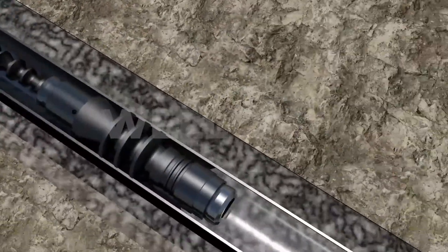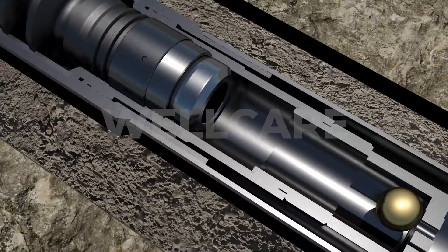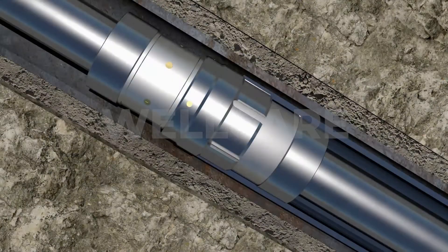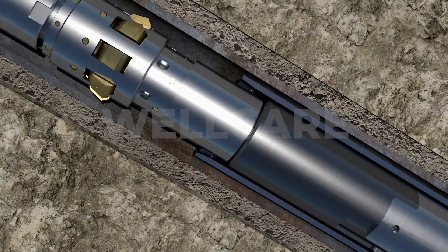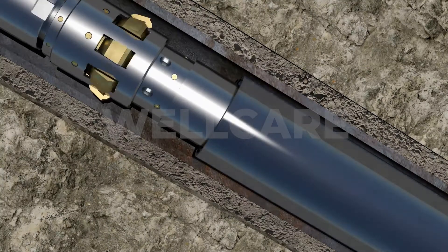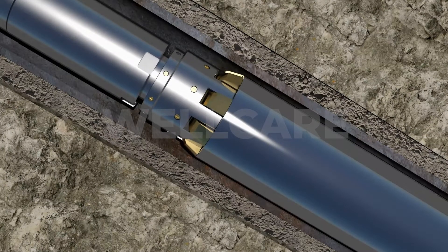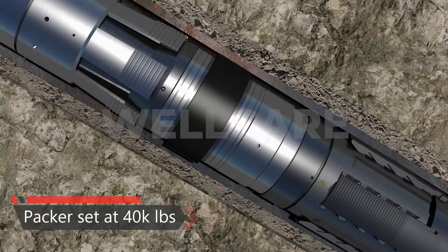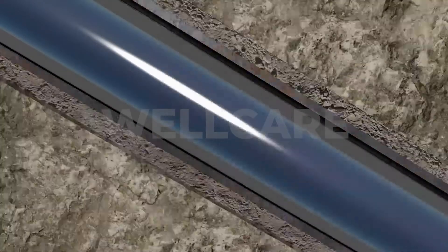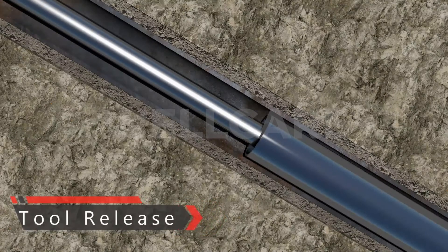Good quality around the liner shoe float, which is integrated in the reamer shoe, will prevent cement from U-tubing back inside the liner. It is time to set the packer. The running string is picked up until the rotating packer setting dog sub is out of the liner top. A set-down force is applied; hold-down slips are pushed up a cone until they bite into the host casing and the packing element seals up. The running string can then be pulled up until pack-off seal integrity is lost, allowing circulation to be established at the liner top to flush excess cement out of the hole.